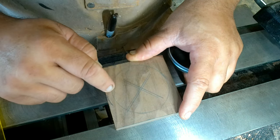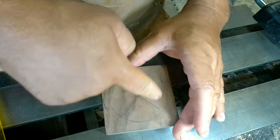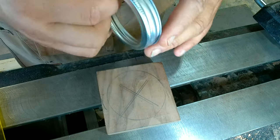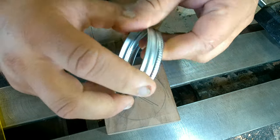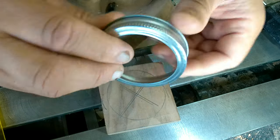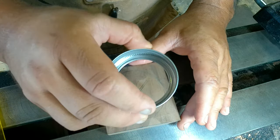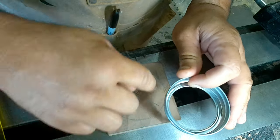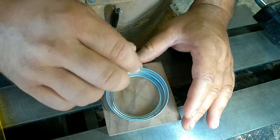But if I get too close to this line, this isn't going to be useful. It'll crack when I shove this in there. So I need to make sure that I give myself a limit. Keep the ring around. These aluminum rings are as close to identical as possible, but they're not identical. They're stamped, and there's going to be a little bit of variation in each. So I highly recommend that you keep the ring that you're going to put in each lid with the lid, and you shape and hollow and make a recess that fits each individual lid. That's the only time-consuming part of this project,